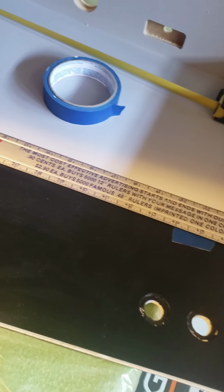So one of the things that makes this tricky, obviously, is that my TV playing field is going to be on an incline. It's about 6 degrees, 6.5 degrees, which is like a traditional pinball machine. Making these measurements, I realized that I actually have to do it on the other side as well. So they have to be quite precise.